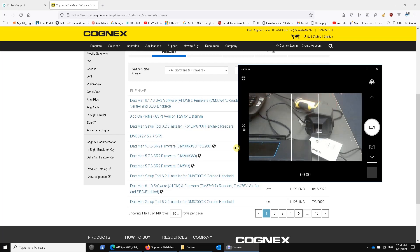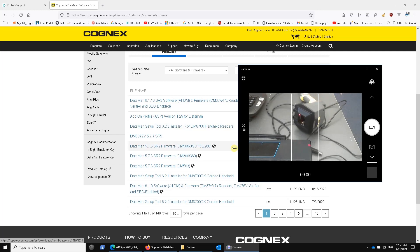We're going to start by connecting our power. Remember, it takes about 45 seconds for it to actually power up and go beep, and we don't plug in the USB cable until that has happened — just to keep things from getting confused in the Windows world. The process of installing the software before you plug in the USB cable is really just a USB thing.